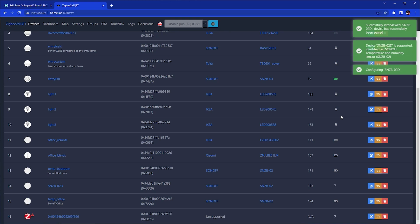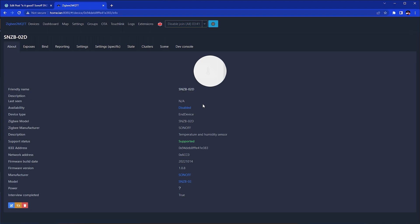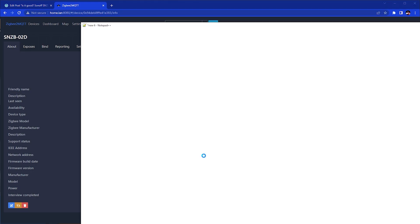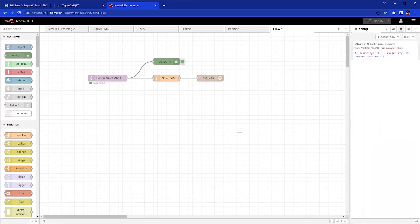The best possible experience you're probably going to have is with a custom coordinator, and that's what we'll talk about next. I used it with Node-RED and Zigbee2MQTT because that's the best way to figure out how responsive the sensor is. As this is a brand new device, it wasn't supported by default — it paired OK, but first I had to dive into the converters, find the file responsible for Sonoff devices and add my model number to the existing Sonoff entry, since they report exactly the same things. Once that was changed and saved, my sensor started reporting temperature, humidity, link quality, and battery.